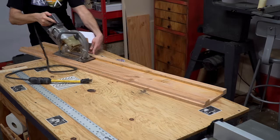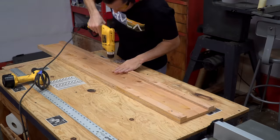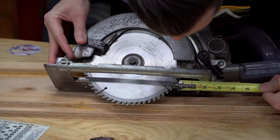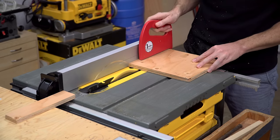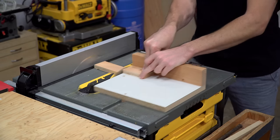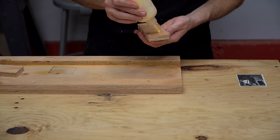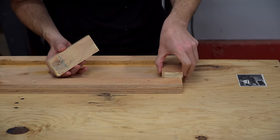When testing, the saw had a very nice sliding action. I then added screws to the second guide to finish attaching it to the track. Based on the blade's distance from the end of the base, I cut a couple of small pieces to work as stop blocks and also trimmed a bit of excess from the track. I secured the stop blocks in place with glue, pins, and screws.